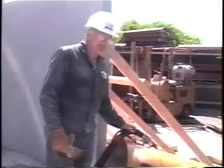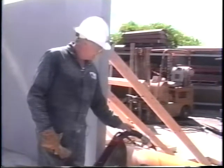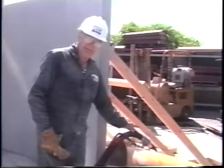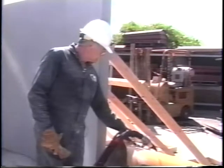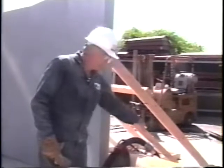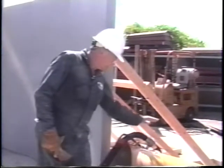Anytime the gunning nozzle is stopped for operation, whether you're on a scaffold or whatever you're on, from the wetting point out to the nozzle tip should be pointed down. So if there's any water leak in the nozzle valve, it does not go back down the hose into the gun. It must be dripping down on the outside where it will not cause any problem. Always point the valve, assembly, wetting chamber, and everything down.